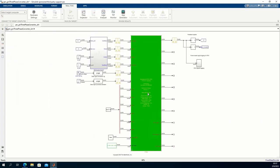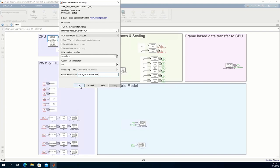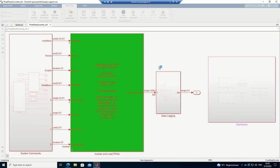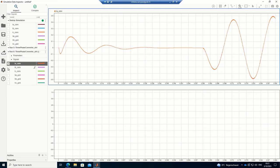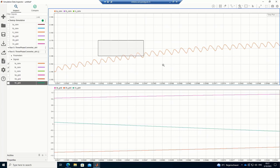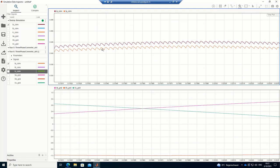The green subsystem is now pretty much empty and only contains the interfaces from the CPU model to the FPGA. For example, the setup block defines which bitstream is deployed on the FPGA. On the click of a button, we can run the real-time simulation — it's a very short simulation of 0.09 seconds. We go to the Simulation Data Inspector and inspect the results. We plot phase currents on the top and phase voltages on the bottom, all in per unit system. We log the signals with 1 microsecond resolution. We have loaded results from a previous desktop simulation to compare with the real-time results. Running the plant on the FPGA introduces a delay between desktop and real-time, however this will not impact closed-loop testing when introducing a microcontroller.